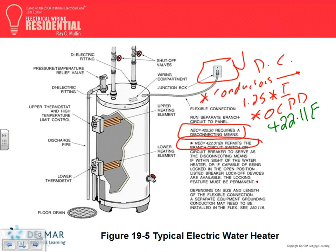And if you read the first part, if the amp of this equipment is less than 13, you have to use a 20 amp. If it's more than 13, then your multiplier is what? 1.5. So your multiplier is 1.5 times the full load amps, basically. And does it say what to do if it's not a standard size? Where the 1.5 is not corresponding to a standard, go to the next highest. Go up.